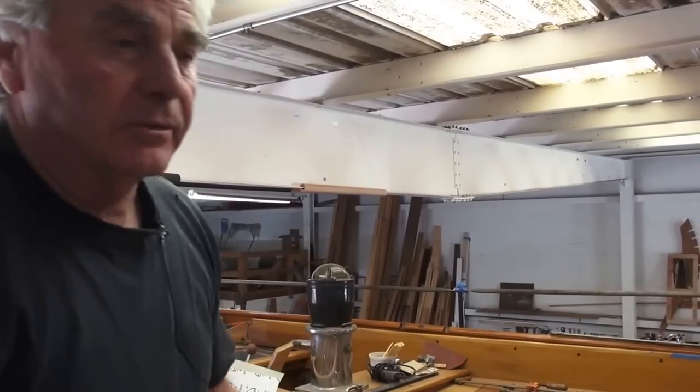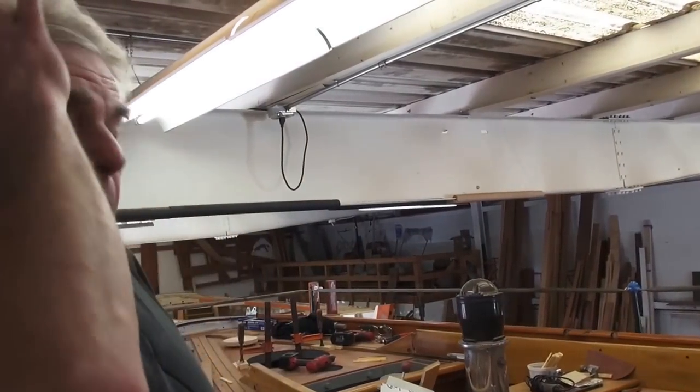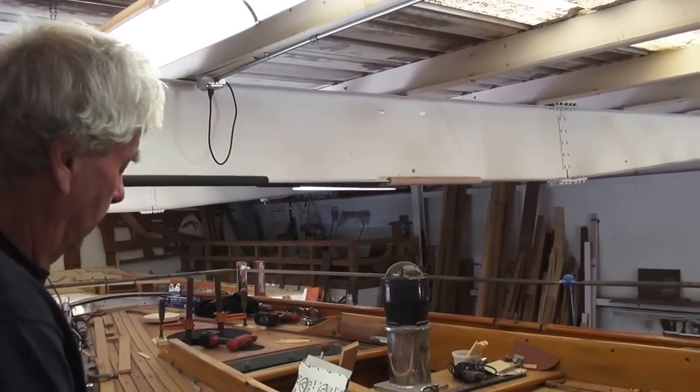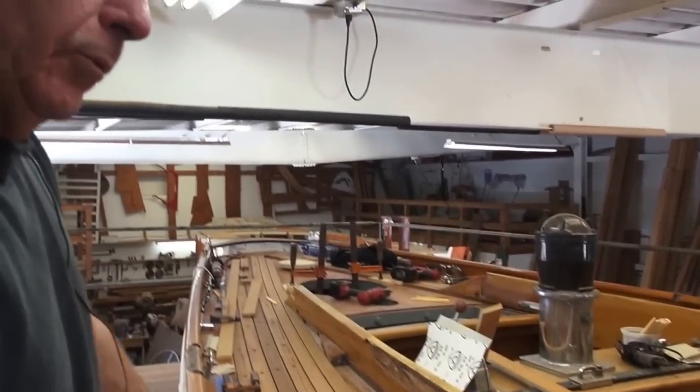The only reason we have the butts the same on each side is so that we don't have to think about it more than once. We can lay out one side and cut all the planks the same. It doesn't matter in any way whatsoever structurally. Just for looks, you want to space them as far as you can with the available material. So what's the plan for what we're going to see now? Well, what we'll do here is we'll probably pre-drill these.